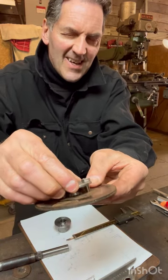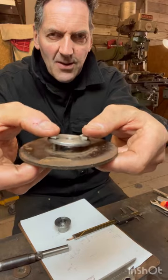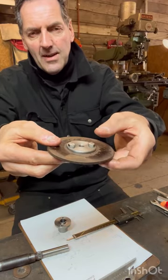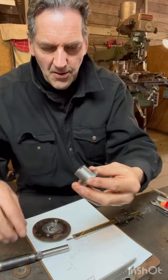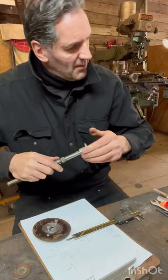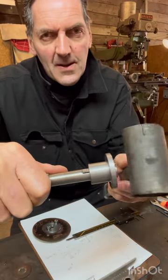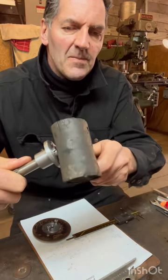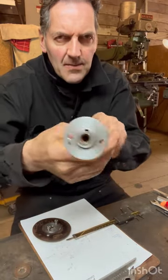Here's the disc and I made a washer for the disc. As you can see it's a very tight fit — the M6 screws are already in there. This is the washer and it has a tight hole for the center bolt, not too much play, and tight holes for the metric 6 bolts that go through. So we can put this one on now. We probably have to softly tap that, so let's get a rubber hammer. You see how the keyway starts to disappear and we still have to go a bit further.